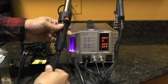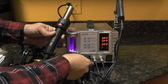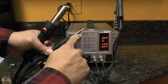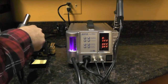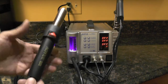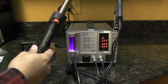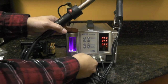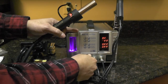With the hot air gun, if I just turned it on now, it would be sucking air from this orifice here, which is very small, going around and actually sucking it from the little tube from the smoke absorber — not going to get a very big volume of air on that. One thing they could have improved on is a separate air inlet for the hot air gun, but they don't have one. So what you have to do is remove this, leave the filter in place, and screw on this cap that comes with it — that allows for maximum air flow out of the heating gun.